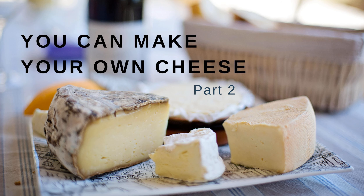The acid rinse plays two roles: first, it's a solvent for mineral deposits, and second, it acts as a residual sanitizer. You only need to use it periodically to prevent the buildup of what is commonly called milkstone. Milkstone builds up slowly as minerals in the milk are steadily deposited on surfaces — not all are dissolved by alkaline detergents, and they'll eventually form a residue on plastic and stainless steel alike. The goal is to remove the minerals before you see buildup by rinsing regularly with a strong acid solution — similar to running vinegar through a coffee maker.